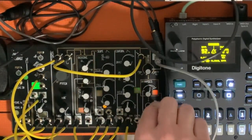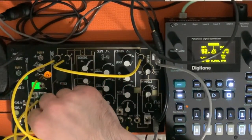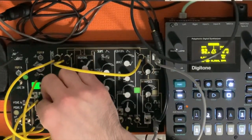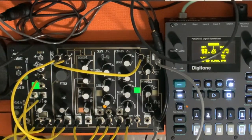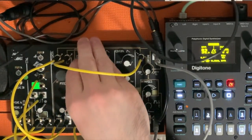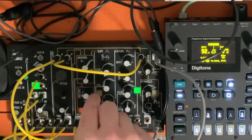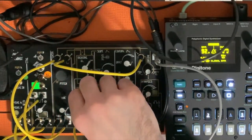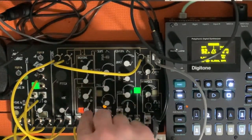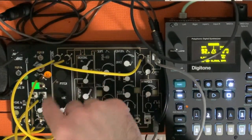Right, so now we're going to make our adjustments. All right, so for the attenuverter, we want this set to basically like 1 o'clock, because we want small positive inputs going into the volt per octave. We're going to make a little, basically a filter ping, sort of the same idea. Overtone is about right at about 1. We want the modulation around noon. Again, here, this is an attenuator, so anything greater than counterclockwise is giving modulation. We want the multiply up, and we want that attenuverter past noon. FM is about right. We can set that to taste.